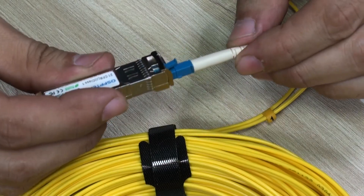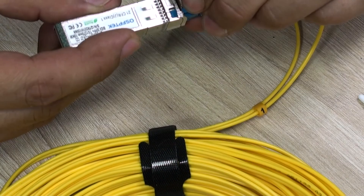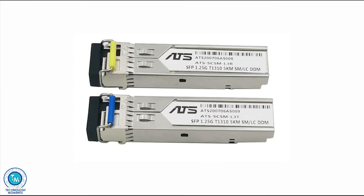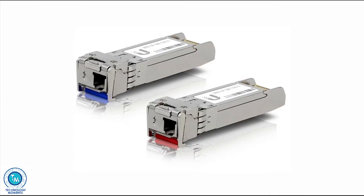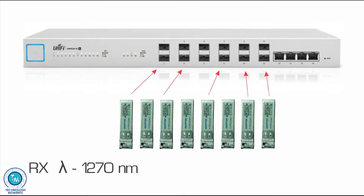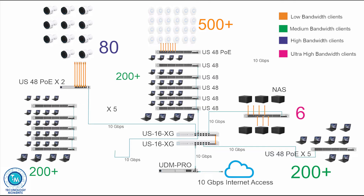If you have a fiber splicer and the time to change the LC terminals, you can choose to do it, but this way works as you are not affecting the locking mechanism nor the polishing of the LC terminal. You might also ask: doesn't that mean that you need to change all the transceivers? The answer is not necessarily, and you have to compare the investment with the necessary fiber cable layout of many kilometers, which may cost tens of thousands of dollars for a medium-sized campus. If you just need to quickly solve a bottleneck in your infrastructure in terms of fiber optic cable runs, this may be the way to go. You can even implement these solutions just for your network backbone. If you are going to change SFP modules for fiber optic runs of just a few hundred feet, it may be more expensive to change these transceivers than just to lay more cable.